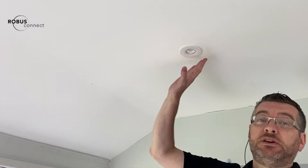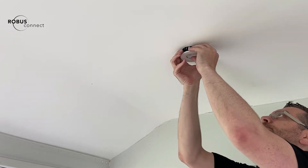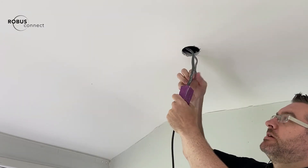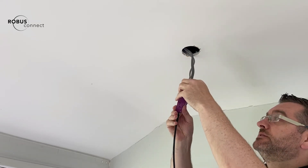What I'm going to do now is isolate the power in here, move the camera closer, and we'll have a look at how to actually install the RX200D. I've identified this as being the first downlight in the circuit, so I'm just going to remove this from the ceiling. I've got my mains switch live coming in here and then it's looped out to the rest of the fittings.